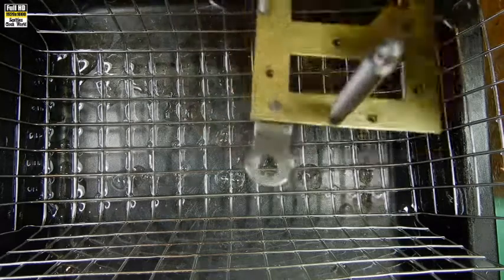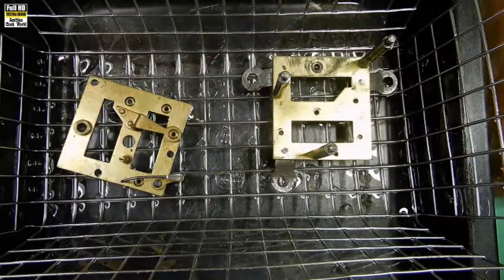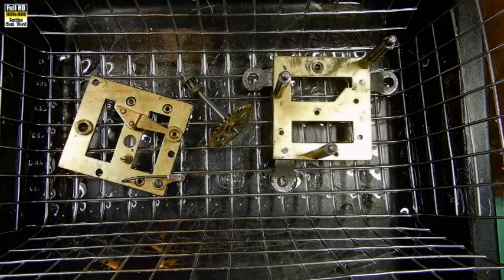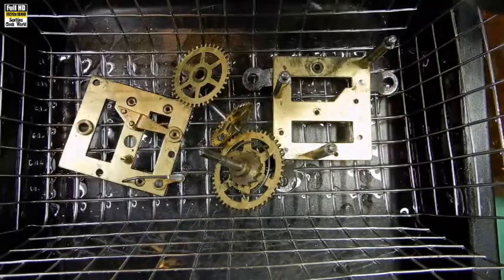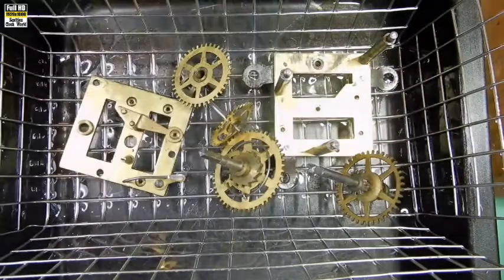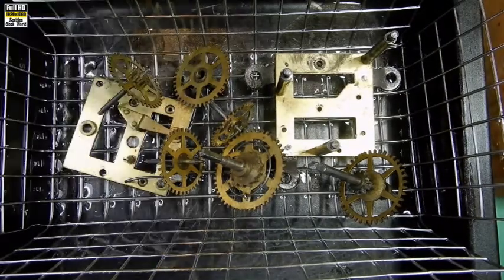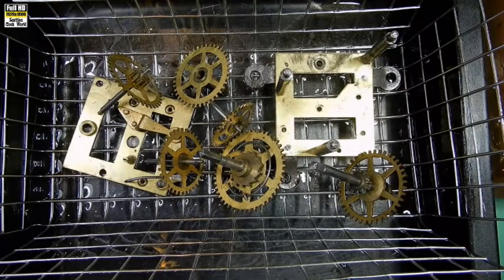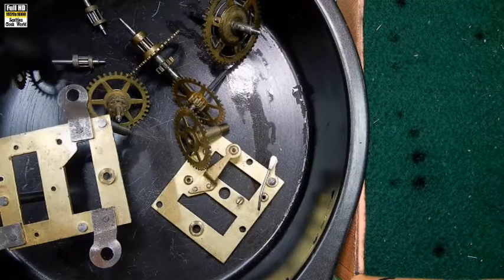There is a picture of the wheels of the movement, each with their correct name, so you can see what they're called. Now we're about to put them into the ultrasonic cleaner basket - back plate first, front plate next. They're small so we can lay them down flat, then the wheels go in one at a time: escape wheel, and motion works - the two halves of that. You can see the wheel on that is looking a bit dirty; we'll clean that with some pegwood once it comes out. Put the rest of the wheels in - third wheel - now we'll take the basket and put it into the ultrasonic cleaner and leave it for five minutes.